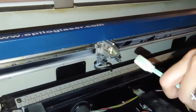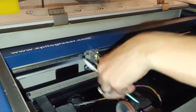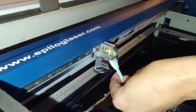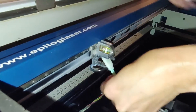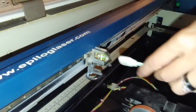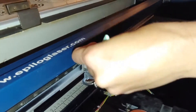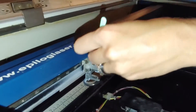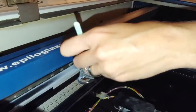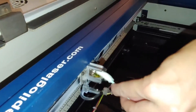You'll add a little bit of the cleaning solution onto the end of your swab, and then wipe the bottom part of the lens. Then on the opposite side of your swab, swab the inside of the lens. If you don't have these swabs you can use the cleaning tissue that comes with the machine, or the cleaning solution, or q-tips — but q-tips sometimes leave particles. That one was a little more dirty on the inside. Then use the same swab to clean the top mirror.